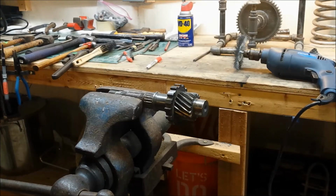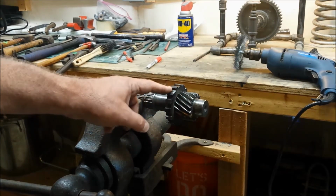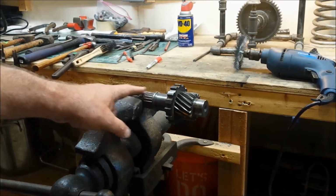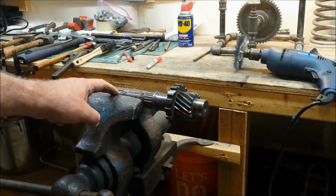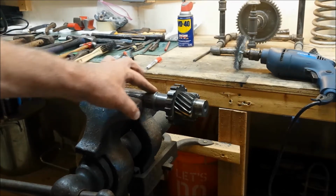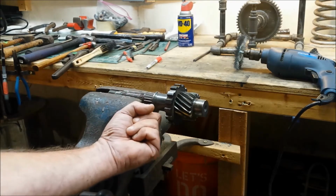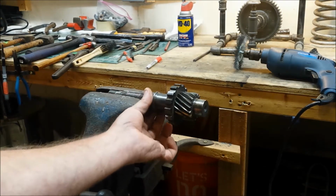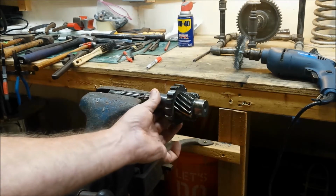Now this gear is cut from a solid steel blank. It's actually a pretty intricate gear. It's got a helix gear over here, hob section over here. This is turned, and then this spline is machined in, as well as these threads on the back. It's a pretty intense piece of machining, and this was a bearing that was press fit onto that. How they got that on there, I don't know. Unless this thing was in two pieces and is press fit.